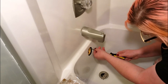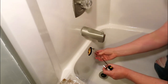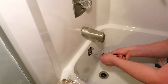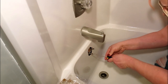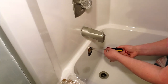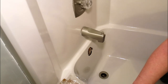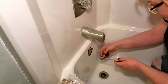Since we don't need the plug for this bathtub, we had removed the old drain equipment and all we needed was to attach the overflow plate. To attach it, there's a little bracket that screws into the drain behind the bathtub wall, and then the plate screws directly onto that bracket. I ordered this cover in the satin nickel finish and wasn't sure if it would match the spray paint well enough, but it ended up being a close enough match that I just left it as is and attached it.